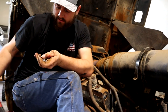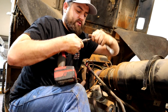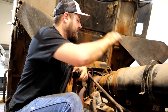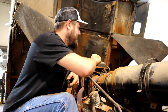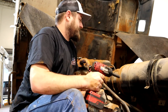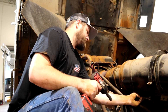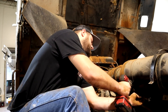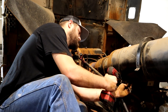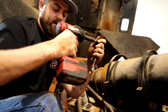We've already got a little bit of a head start on pulling this radiator out of the truck. I'm gonna go ahead and remove the air cleaner on it. We've removed the intake pipe because we've got to change the intercooler boot on the front of that turbo there, so we've got to pull this off anyways. Let's go ahead and get it out of the way before we get too carried away.